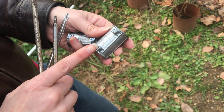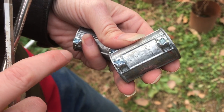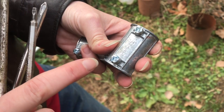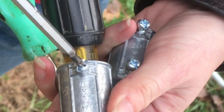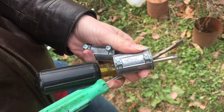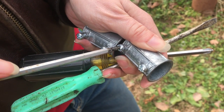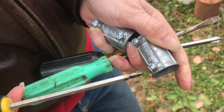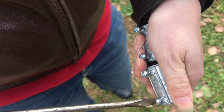These conduit connectors have screws with a funny-shaped head that can take a flathead, a Phillips, but also a square-headed screwdriver. We have found that the square is the most effective at turning these, especially when they get jammed up — you need that square in order to keep it from slipping, because the flathead skips out even if it's a smaller flathead.